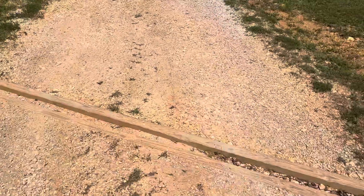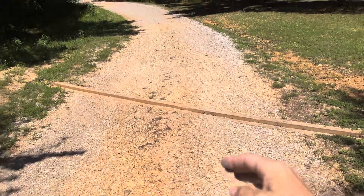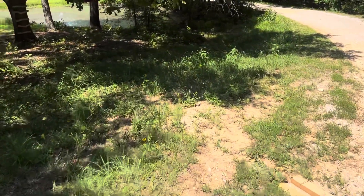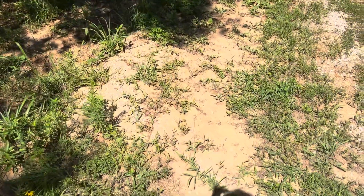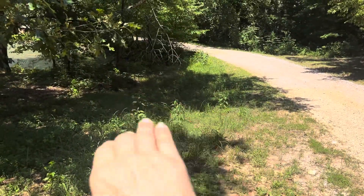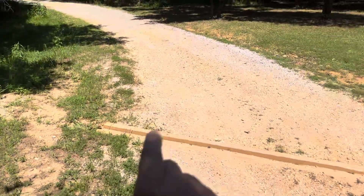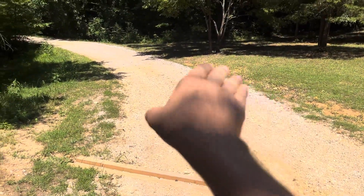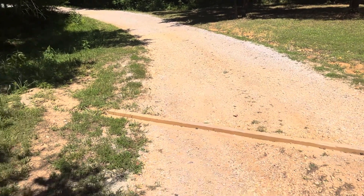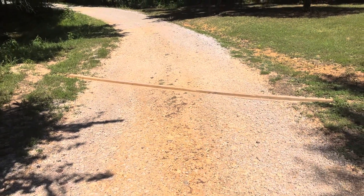On this water break, it'll hit there — I put it at an angle across my driveway. You can see out here the silty runoff. I'll come back every now and then with the box blade and scrape it. There's a low spot right here and that's where I'm pushing the silt. Had I thought more about it, I probably would have angled it the other way since I've got a ditch there — but that would have clogged the ditch with silt, so maybe I made the right choice. Things to think about when you're putting one of these in.